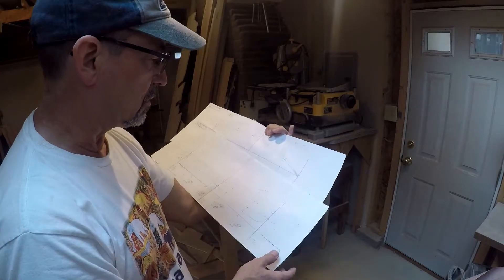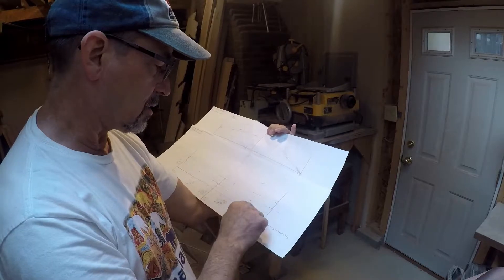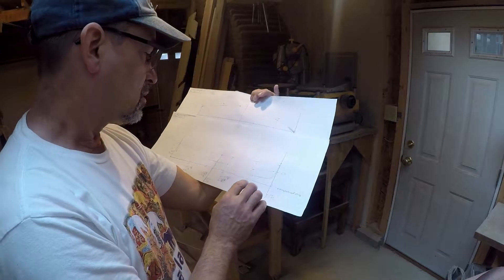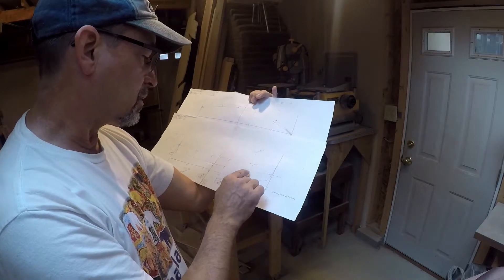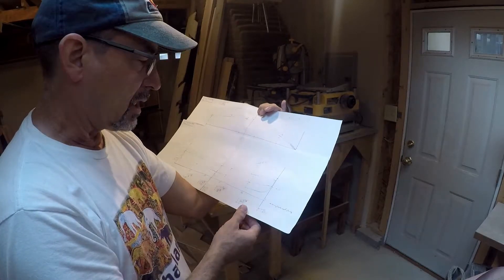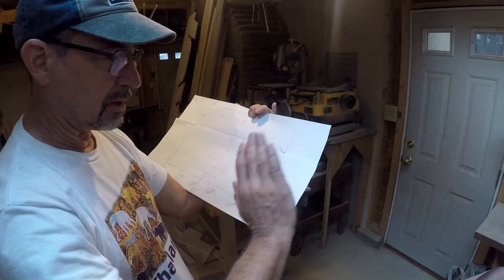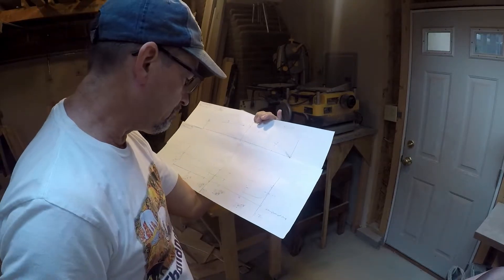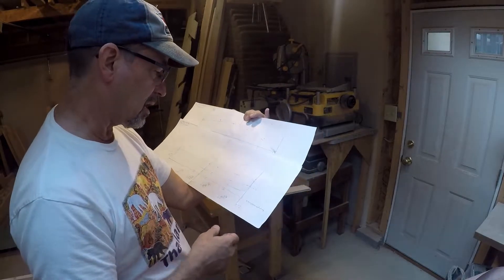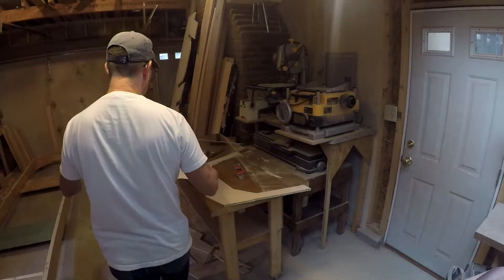By the time it gets here, it's nearly vertical. So what I found is — and it also has a curve — the bottom lays down across this curved shape here. What I found is that it wanted to have a slight radius over the top of R1 at that point, and I had to retrofit that by putting in a one-by and planing down that curve with a gap. So I'm going to see if I can actually anticipate that — I'm taking just a bit of a guess at the radius, but here's how I want to do it.